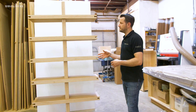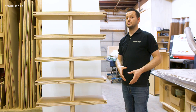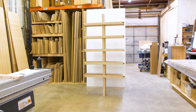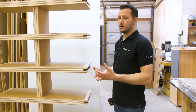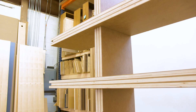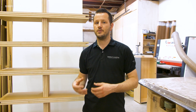Now we have the small bookcase fully assembled — we just did a dry fit to make sure all pieces fit and the openings are where we need them. It also helped determine the best cutting method so the larger bookcase, which has four uprights, can be more streamlined. The next steps are to disassemble it and prep for finish. I noticed I was supposed to leave solid blocking in the front so the front edge has support for edge banding — I'll just add a small block there. Then we can edge band all parts, trim them to final width, and send them off to the finisher. We have something special this week — we're including a recorded live Q&A from Instagram.